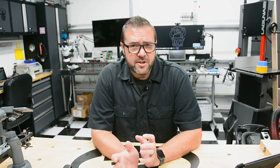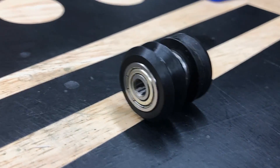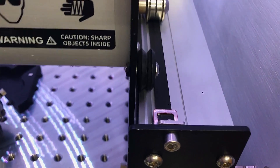With the eccentric nuts replaced, it makes sense to upgrade the V-wheels. The V-wheels determine how well they're tuned, and their hardness determines how rigid your machine is. If you have slop or soft V-wheels coated with dust and debris, it likely won't be as accurate — you may experience jerky movement, poor dimensional accuracy, and even worse, inconsistent repeatability, which can be a nightmare when milling tight tolerance parts. The wheels I used are a direct replacement to the existing wheels, but slightly beefier with a sealed bearing and precision shim. You may need to file your belt tension brackets to prevent interference with the new wheels. The stock wheels are fine for most people, but if you want to squeeze more performance from your machine, a higher durometer wheel helps out.